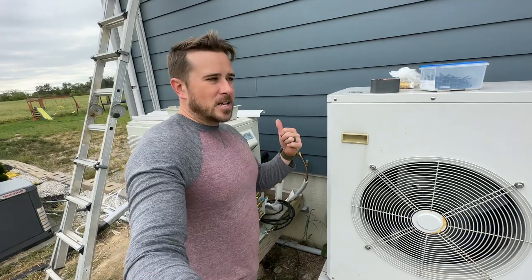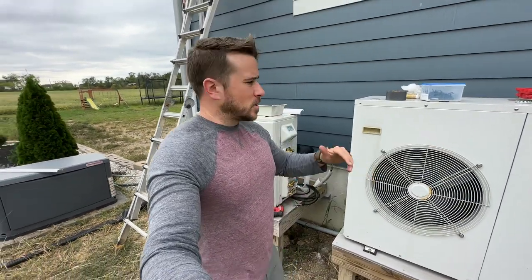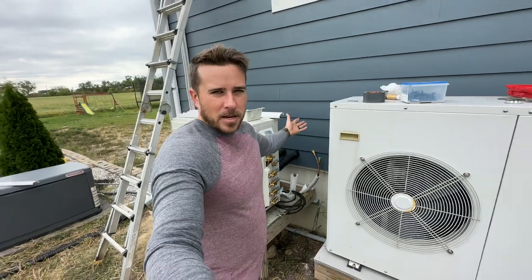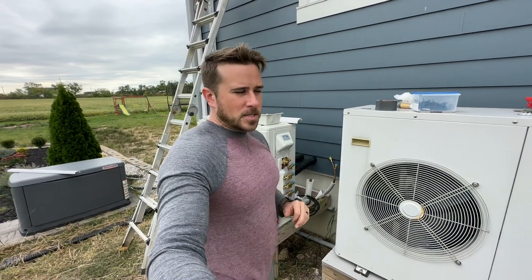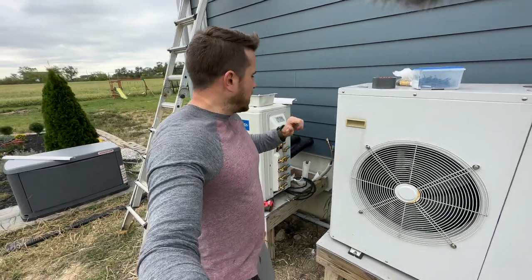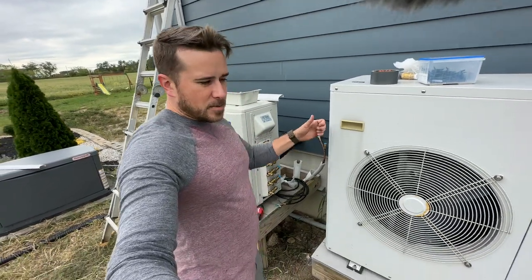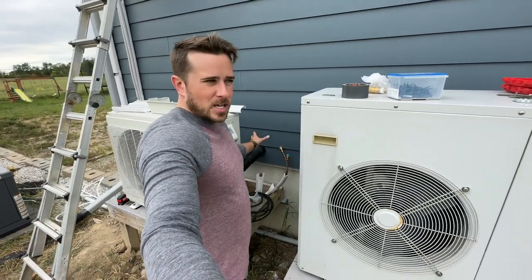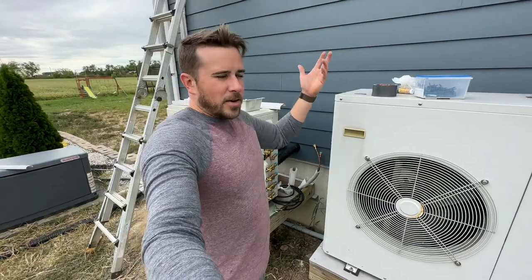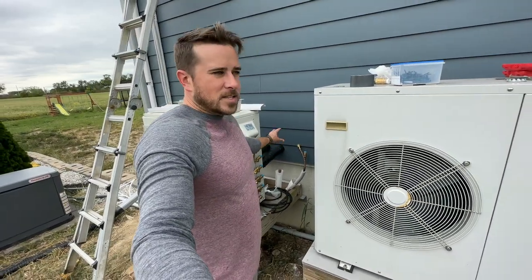Something else that's unfortunate for my situation is that the 18,000 BTU unit I'm not installing yet was going to be part of another coupler line set setup. I wanted to have this outdoor connection run into the house and just sit there with the foreign material caps on for protection, with everything out here done. However, the Titan outlet I used on my other unit is apparently on backorder, so I can't finish that part yet. I've got to go ahead and finish this without having that stuff to work on.